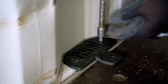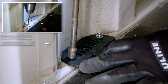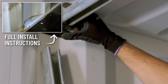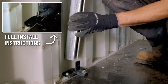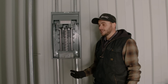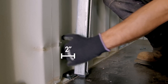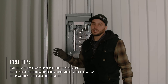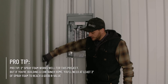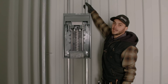For installing these CSM brackets, I'm not going to get into too much detail since we're getting repetitive with them — check our other videos if you've purchased them and need to know exactly how to install them in the insulated or non-insulated positions. Because we're insulating this container, we have all the strut channel installed in the insulated position. There's about two inches behind here, which allows the spray foam to get all behind the strut and make a nice vapor barrier. Same thing on the end wall — there's room behind the strut.